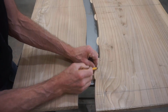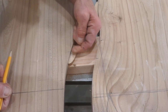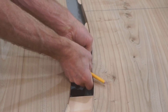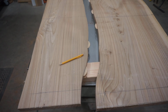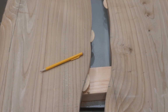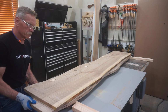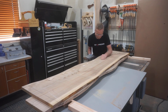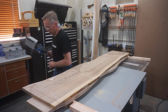And I'll have to do some fussing to make sure these all fit, but I can easily do that by marking the biscuit in one slot and slipping it into the other and see if it covers up the pencil mark. It's going to take about an extra 1/8 of an inch. So I think I'll just set the slot cutting depth a bit deeper and replunge these so that everything works out. And I'll admit that I misjudged the effect of the curve on the depth of the biscuits completely, because only one of this dozen actually fit without replunging.